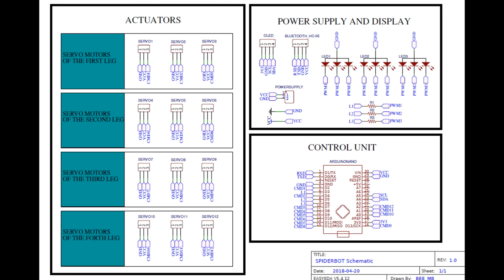So I've made this one that you can download from the link in the description down below. All legs will be controlled by the Arduino Nano, and also the OLED display and the RGB LEDs. Do not forget to place the Bluetooth connector and a separate DC power supply source for the servos.